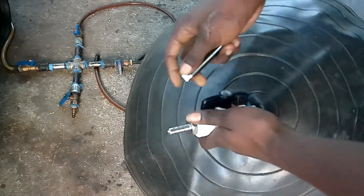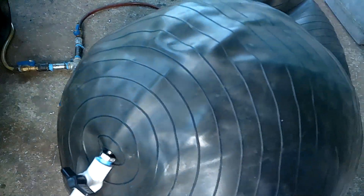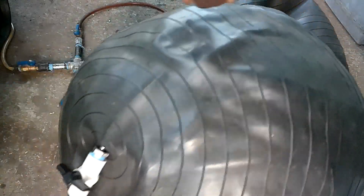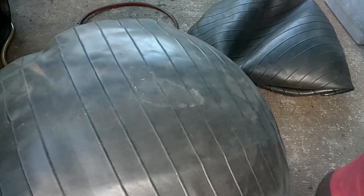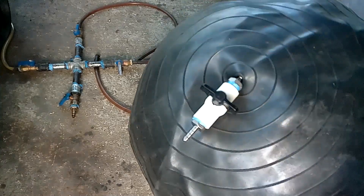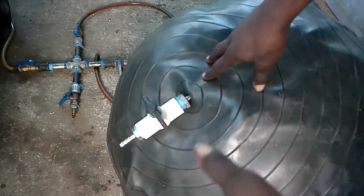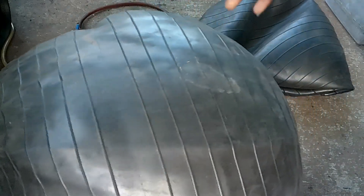To prove this gas is calorific — must I say any more? This is a lot of energy in this ball. I would say minimum three to four kilowatt hours — that's a minimum. According to our math, if this was around the same composition as natural gas, this would be 6.8 kilowatt hours in here. This gas isn't natural gas, but we know from research papers there's methane in here, hydrogen, and other hydrocarbons like propylene. All those things are very energy-dense. We also know there's carbon monoxide and carbon dioxide — those are known products of pyrolysis. With all that said, this is at least three kilowatt hours in this whole ball.